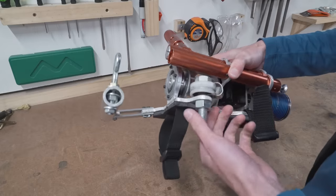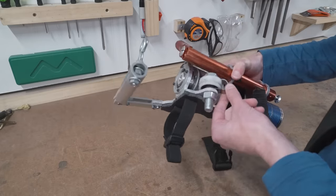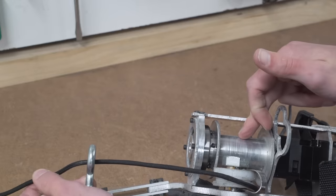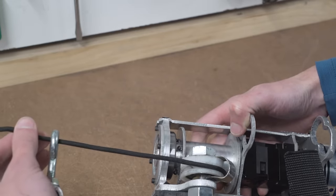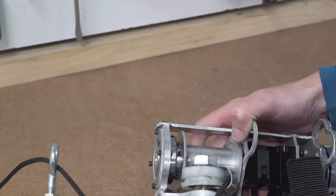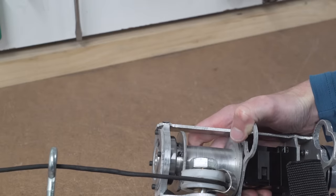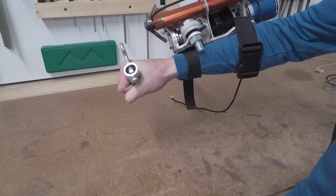And I've made this really cool upgrade here. The pulley still spins the way it always did before, but now I've added this extra shield to it — it's modified so that the string won't come out if it's passing through there. The idea is you've got the cord wound around the reel, then it goes around the pulley, then through the eyelet to keep it straight. Previously, if you're pulling it's fine and then suddenly you get a bit of slack — the cord comes off the pulley and you're stuck. What this captive ring does is, when you re-tension it, it pops straight back onto the pulley. It seems to work perfectly. I'm really pleased with the design — it's super compact and elegant.